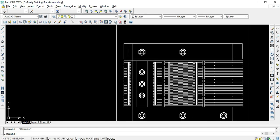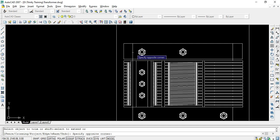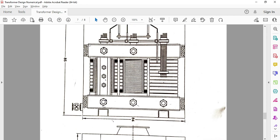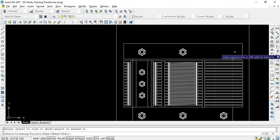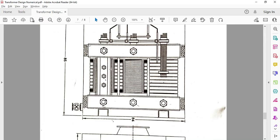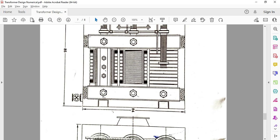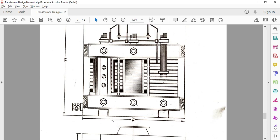These are the channels fixing the laminations, so the core will not be visible here — I'll delete that line. The nut bolt is not visible due to the tappings, which is why it hasn't been drawn there. To have a gap between the tank and the core, there is a wooden part that I need to show.